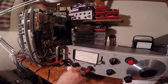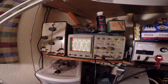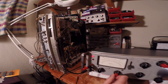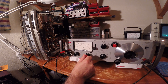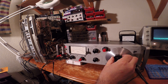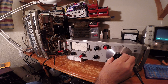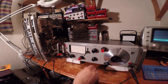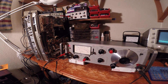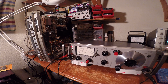Now we're going to up the power a little bit. If you take a look over at the oscilloscope, we're going to take it up another 5 peak volts, which will take it to 6.25 watts. Then we're going to set the level on the distortion analyzer again, null it, and make a distortion measurement. That distortion measurement is holding at 0.03% distortion, which is really 0.01% because the frequency generator has 0.02% all by itself.